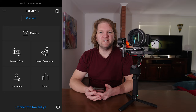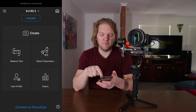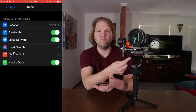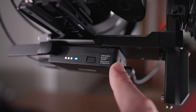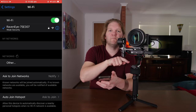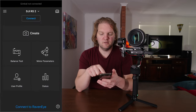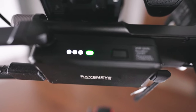Download and install the DJI Ronin app and create a DJI account if needed. Once logged in, don't click the connect button at the top — instead tap the 'connect to RavenEye' link at the bottom. To use the app you need to connect your phone's WiFi to the WiFi access point in the RavenEye image transmitter. On the back of the RavenEye unit it'll tell you the WiFi access point name — it starts with 'RavenEye' and a few numbers. Tap that to connect and if asked for a password, it's also on the back of the unit. Once connected, the light on the RavenEye goes to green, meaning it's connected to the app.